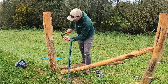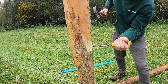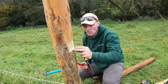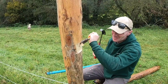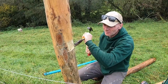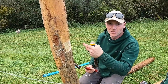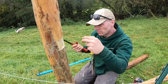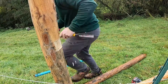I'll film a bit of this too. It's just trying to get the face of this notch to be kind of in line, otherwise it's not going to sit flush. I think it needs to be squared up a bit. The difference with doing this - whereas with the creosote and the treated timbers, every time you cut into it you're exposing virgin timber that will basically rot quicker. Because we're going for these hardwood posts, any cuts, as long as water's not getting in anywhere and trapping, we're not exposing anything that's less durable. Alright, let's just neaten that out.